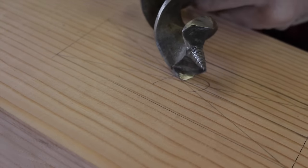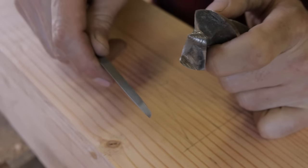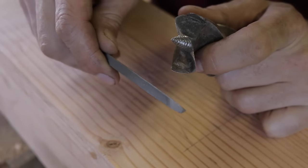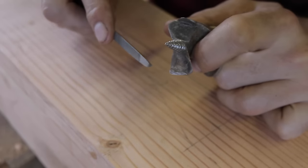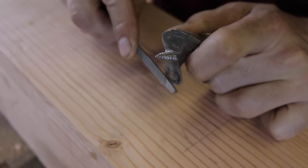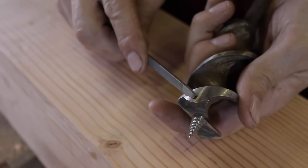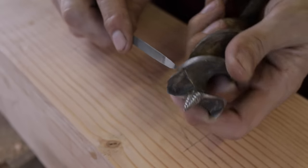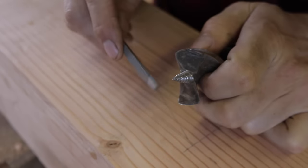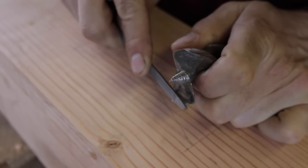You want to keep these bits tip-top. What's nice about old tools is they're designed to be serviced. Maintaining and sharpening these old auger bits is simple — just a small three-sided or six-sided jeweler's file. You sharpen the little cutters on the side, but sharpen from the inside only. If you sharpen from the outside, you'll make the bit smaller and lose that inch-and-a-half width. Good light is important so you can see if your angle is correct.